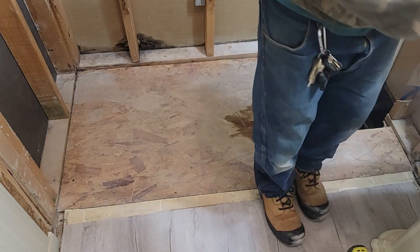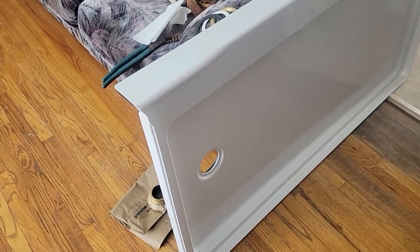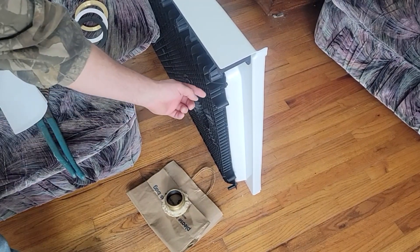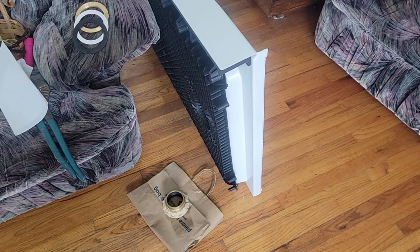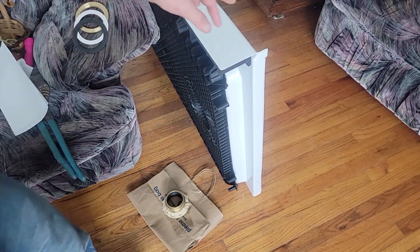I came out to the living room where there's a little more room. Here's our shower floor pan and it looks in nice shape — no damage on it. The base has an attached plastic webbing every one inch, so this is designed for a substantial amount of weight without any issues. They say it's a no-mortar install like the old tub, but they do say you can go ahead and put a little silicone or adhesive on it — that probably keeps it from creaking and moving around since it can't lift up. We still have to drill and attach it to the studs.